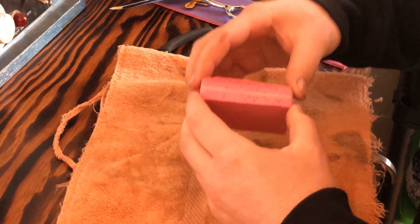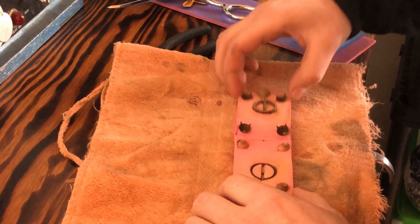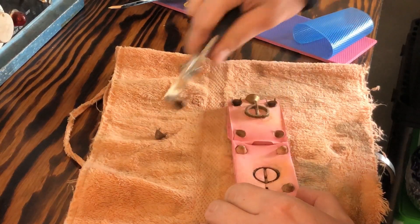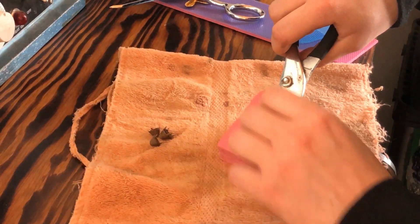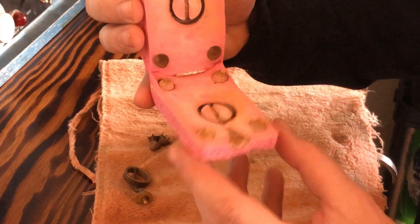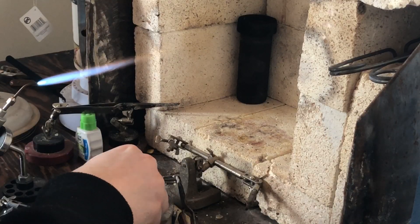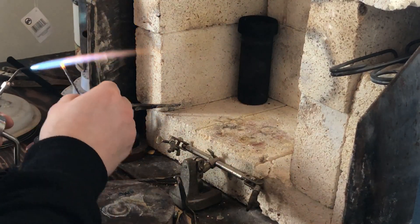The mold is all cleaned up now, and here's the magic of the separation cream — it peels apart like a banana with very little effort. You can leave a bit at the very end to create a flap if you want; that's entirely up to you depending on the design. I did put the mold locks on the wrong side — on the separated side — which means they came out the way they did, but it's not the end of the world. I can slot them back in and it shouldn't be a problem.